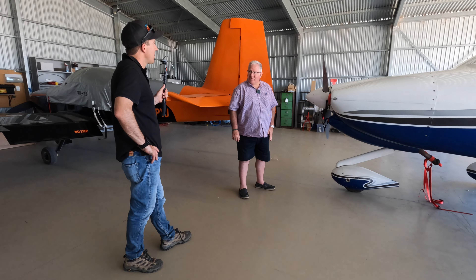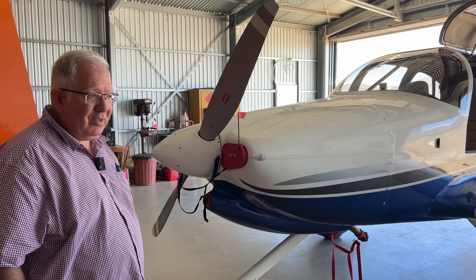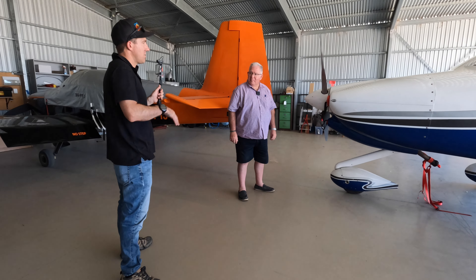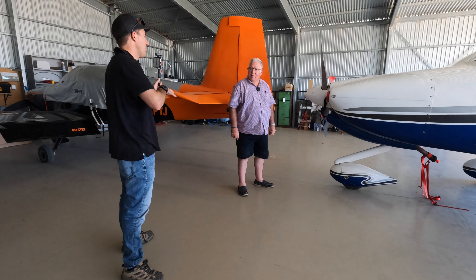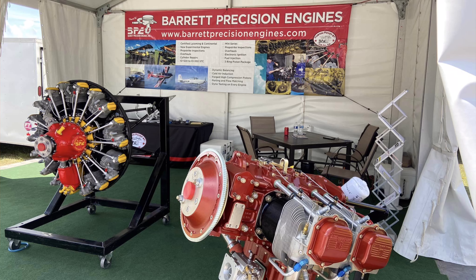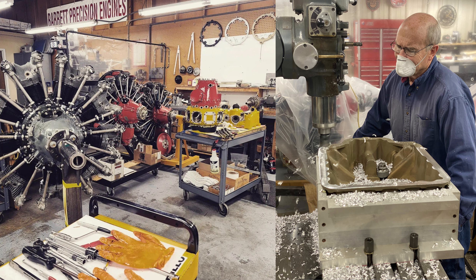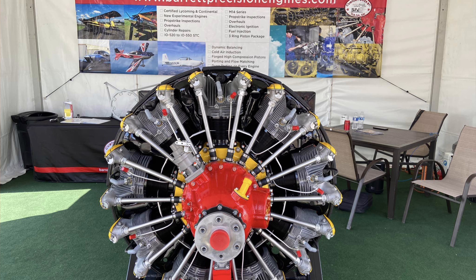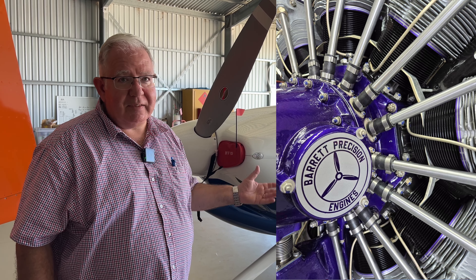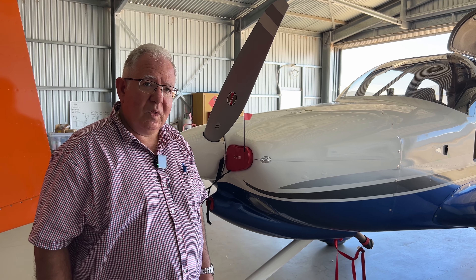So it's not turbocharged, but it's a poor man's turbocharger — without having a lot of the complexity of a turbocharging system. The engine was custom built by a group that produces engines for racing aircraft in the USA. It's essentially a Lycoming engine — they purchase a core and build it up from certified parts. They did port-match a lot of things and did some balancing you wouldn't get in a normal engine. So you're running basically standard compression but it's ported.